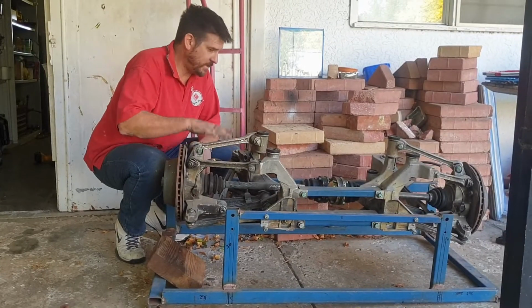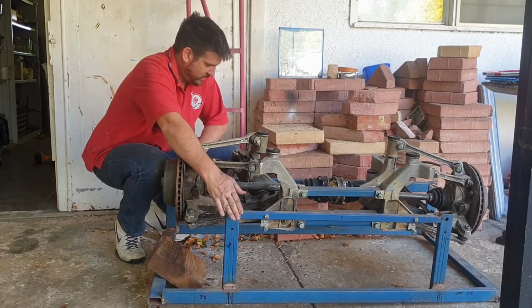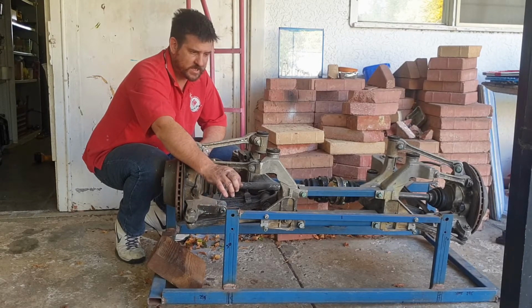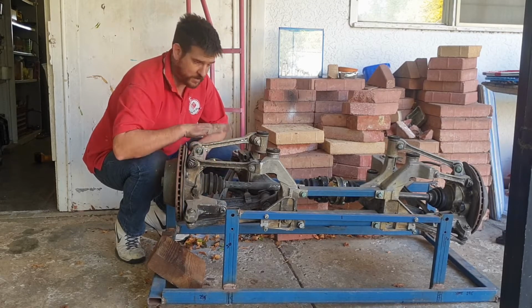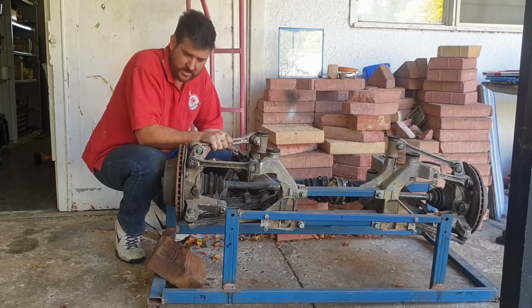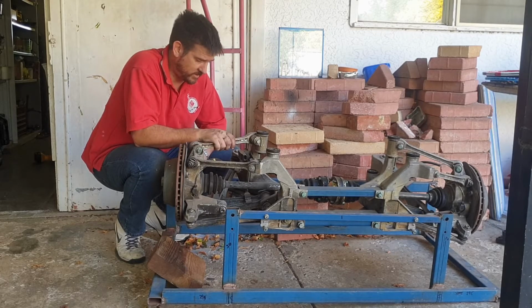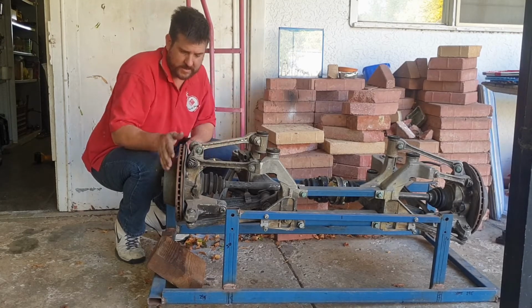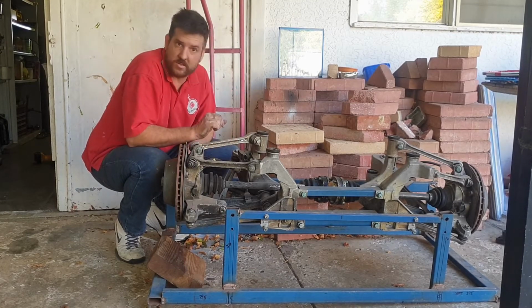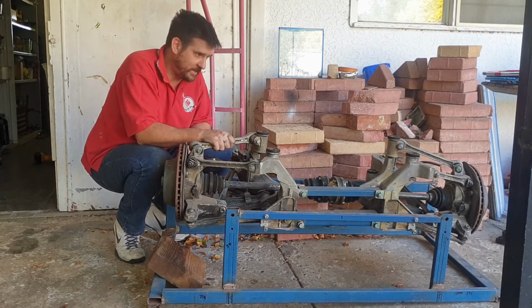Okay, so down the rear, I've pulled the rear suspension out. It's currently temporarily mounted on this support frame just to hold it roughly in position. We need it to go up 65mm from this position. This rear suspension's out of a Porsche 996 911. We have had to narrow it slightly to get it to fit, but we're going to basically use the whole Porsche rear end. So our next job is to get this mounted.